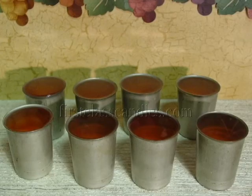After the molds are heated, the 200 degree wax is poured almost to the top, but not right up to the very edge. It's better to slightly under-pour than to risk over-pouring, because if the molds are over-filled at this time, there won't be sufficient room for a proper re-pour later.